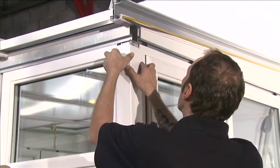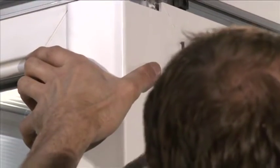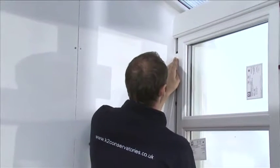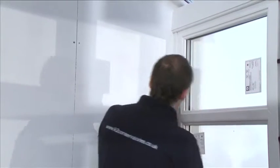Push the corner post onto the leg of the post and slide upwards until the front meets the eaves beam. Position an 18mm coupling cover over the barbs on the inside of the post and push to fit. The 18mm coupling covers will need trimming to fit underneath the external eaves beam trim and eaves beam cover.